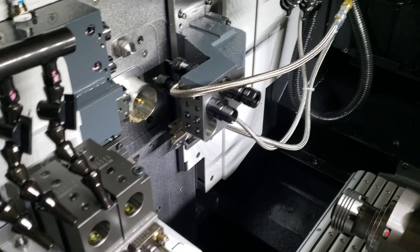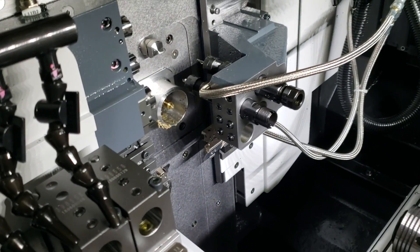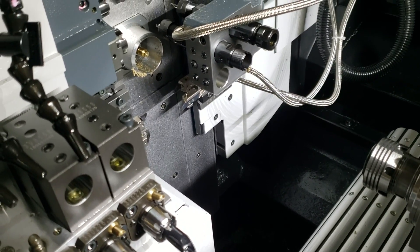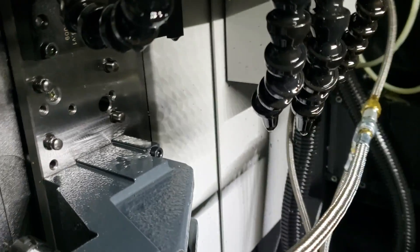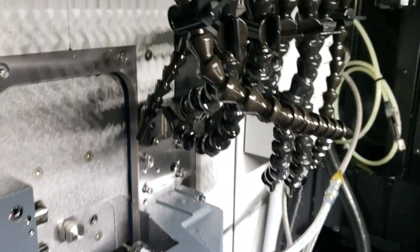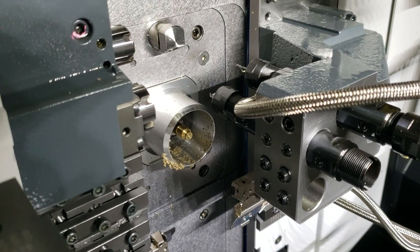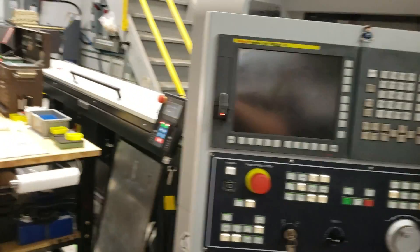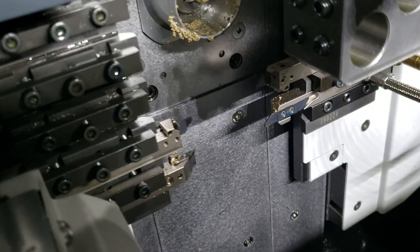So we'll take a little peek inside here. I basically always have a paper towel in my hand because it's so oily in here. The coolant is an oil-based coolant — fairly clear and viscous, kind of like cooking oil. I haven't run coolant in a day or two and it's still dripping from basically everywhere, but that's okay, it's part of the process. I've got a piece of brass in there, three-eighths inch rod, connected to the bar feeder. I got a six-foot L&S bar feeder.